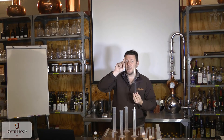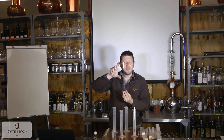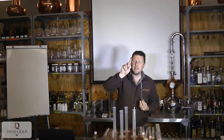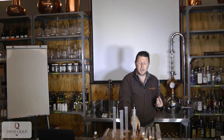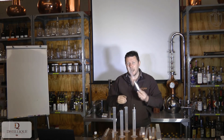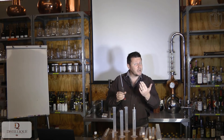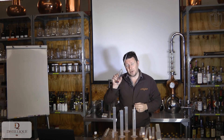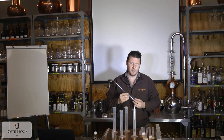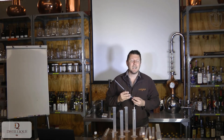These lab-grade meters have a much longer stem, but each one only covers a 10% range — so you get a 10-to-20, 20-to-30, 30-to-40, 40-to-50, and so forth. A single long stem measuring only 10% is why these are so accurate and so expensive, compared to a 0-to-100 meter. But they are highly breakable — you just look at one the wrong way and it will break. Because of that, when you order a lab-grade alcohol meter from us, we cannot courier it, as there is a very good chance it will break in transit.